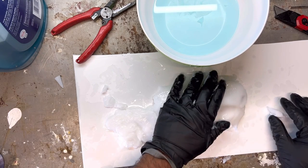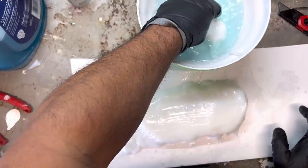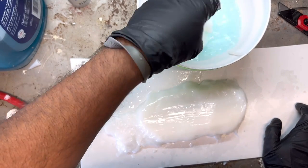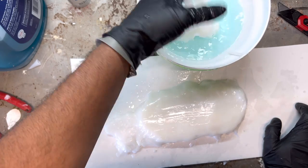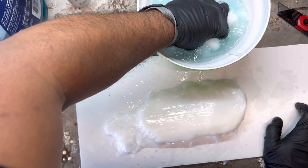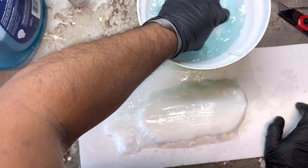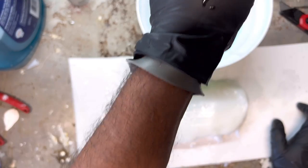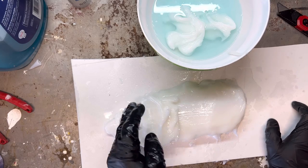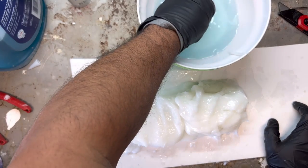The reason you want clear silicone instead of white silicone is that with white silicone you can't tell when it activates. The clear silicone will turn white once it's ready, so you need to know when it's ready — that's the only reason. Right now it's pliable, and this is when you would mold it to whatever you're molding. This took three tubes to cover one side, so six tubes would do okay for what we're trying to accomplish here.